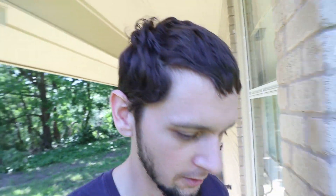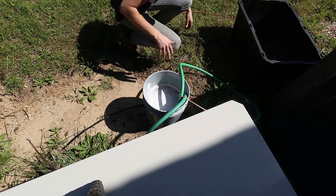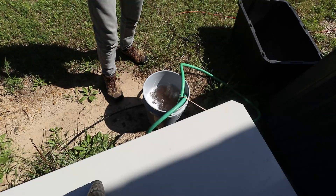Now I've got a couple of ball valves open and a couple of indoor units on, which means they should be calling for cooling so their ball valves should be open. Back outside — the pump seemed to self-prime, so if I plug this in we should be good. That's better. We'll just let this run for a few minutes and get all the bubbles out.